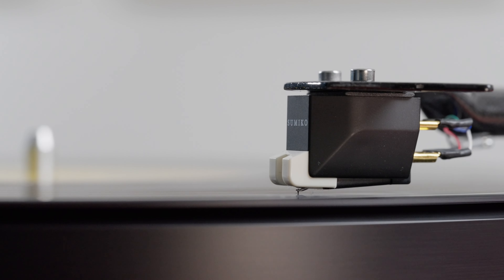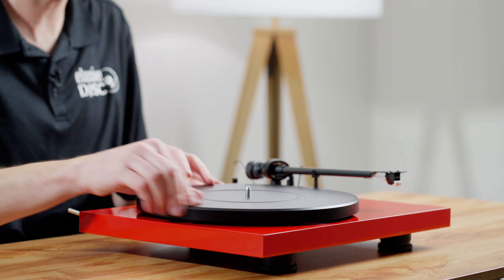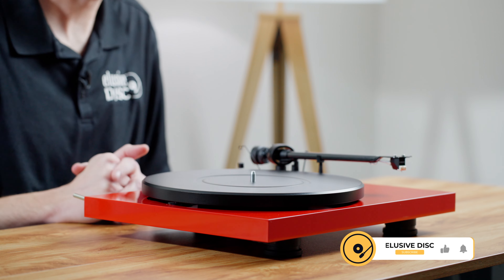Always use the ground — ground hum can get into the system through cartridges due to their low output, and you definitely want to minimize that. So what makes this table better than the Music Hall? Mainly the cartridge — the Sumiko Rainier is a great cartridge and that's a big reason for the price difference. They also spent a lot of resources developing this platter system with Ortofon, making it very smooth. With its sleek design and really good sound, at $598 this is a really great deal.